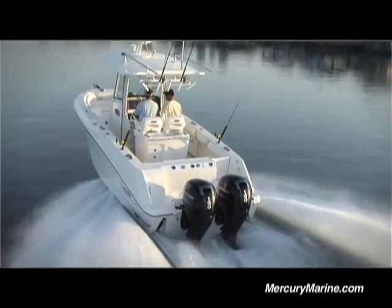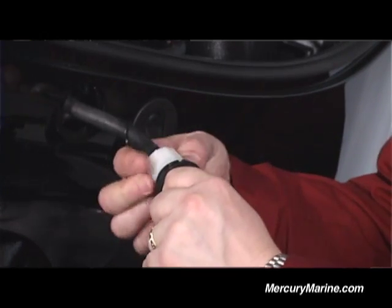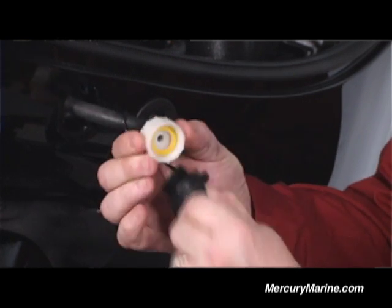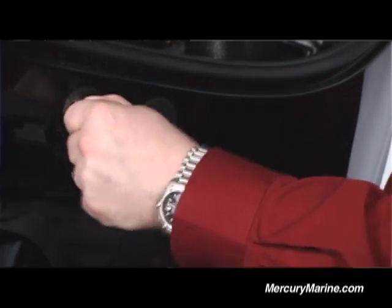For those of you in saltwater markets, we recommend that after each and every use you flush your engine's cooling passageways with fresh water to get rid of salt deposits that naturally accumulate. Mercury's freshwater flush system on the new 150 four-stroke is conveniently located so you can access it from outside the boat if it's on a trailer right here, or even from inside the boat if it's on a lift. Simply turn this cap, pull out the length of hose, and unscrew the swivel from the cap. Attach your garden hose, flush the engine. When you're done, simply reattach the cap, feed the hose back in, and tighten it up.